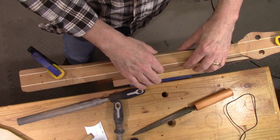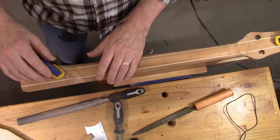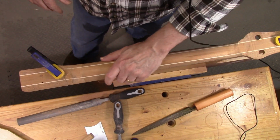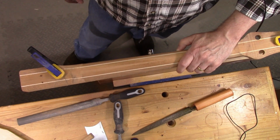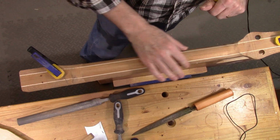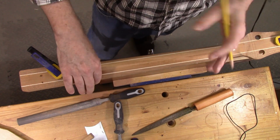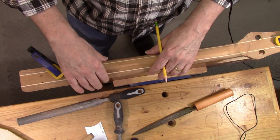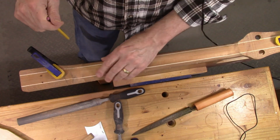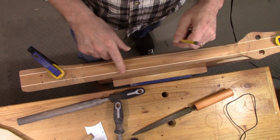getting this completely smooth. There are a couple, like right here, you won't see it, but you can feel it. And if you play guitar, you know exactly what I mean. I'm not in a playing position, but imagine I was. Especially as your hand goes up or down the neck, if there's any little bump, like right here, I literally just do this. That reminds me, oh yeah, take a double look at that spot. And another little one right around in here, where there might have been a little defect in the template or the router bit jumped slightly. You wouldn't see it even up close, but your fingers are so sensitive to that kind of change.